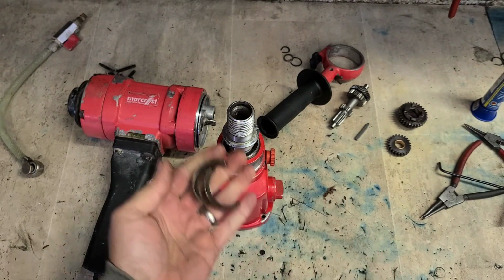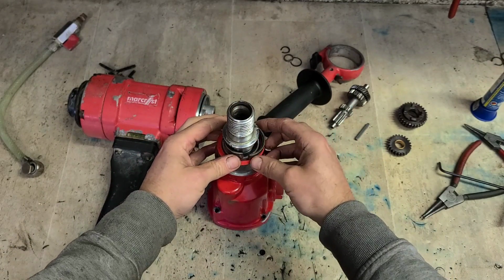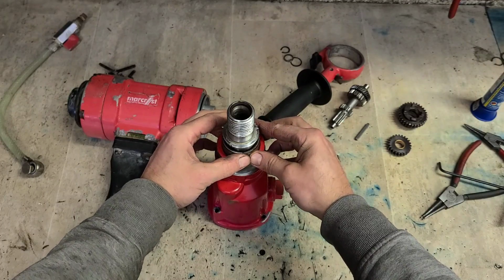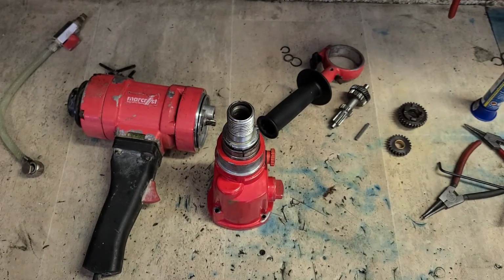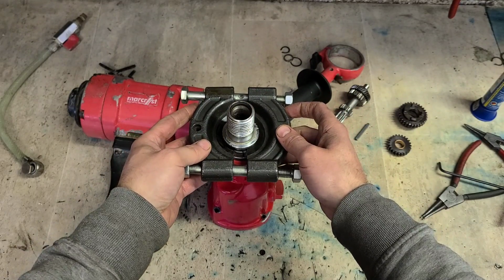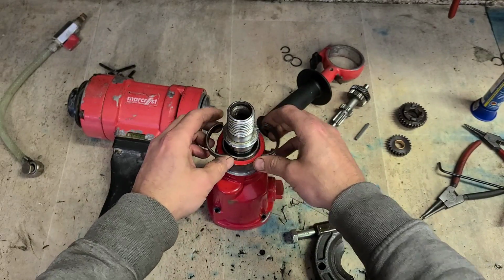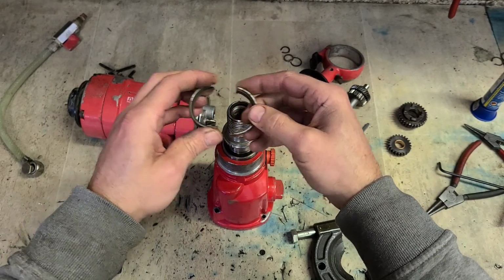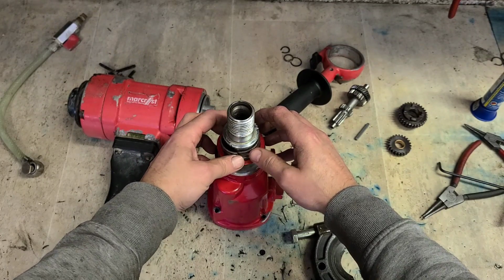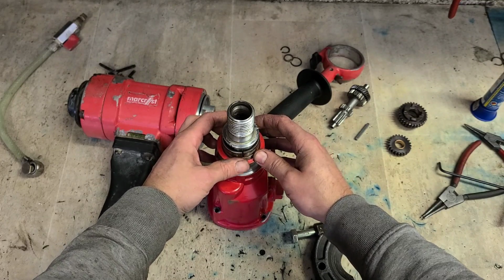With your old bearing, take your old one, cut it in half, set that on top. You can tape it if you need to. Then you can get a set of splitters to sit on top of your old broken bearing to press on the new bearing. Because it's cut in half, it's actually now smaller, so even if it presses down onto the bore, it'll just loff back out again. That's the handiest way to fit it without pressing on the inner race.